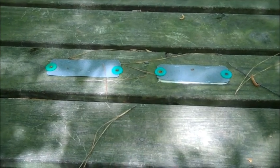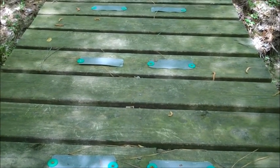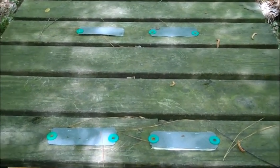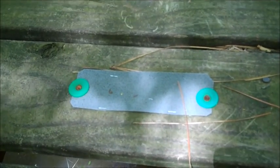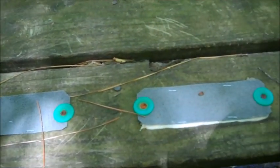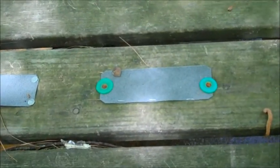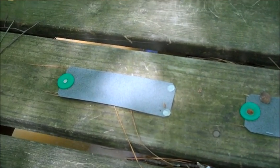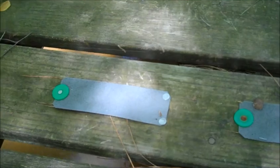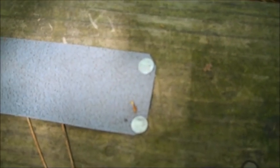Here's another example of a small footbridge, and as you can see on this one I used 5 quarter inch deck boards for the decking material. The other thing I did is I bought these stair treads to give some traction. This bridge is very slippery when it gets a little bit of moisture on it. The stair treads come with an adhesive backing but they just wouldn't stick, and I tried construction adhesive to no avail. Finally the best solution I found was these little roofing nails, which hold it in place just fine.